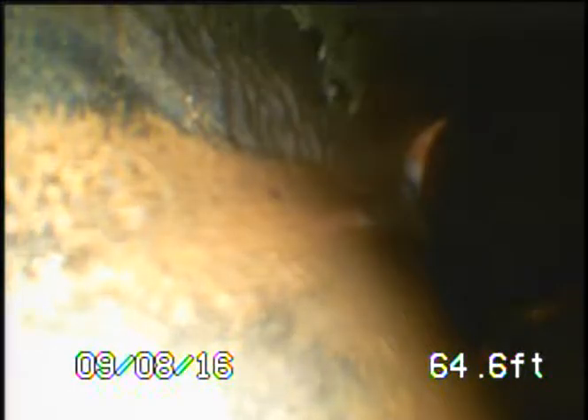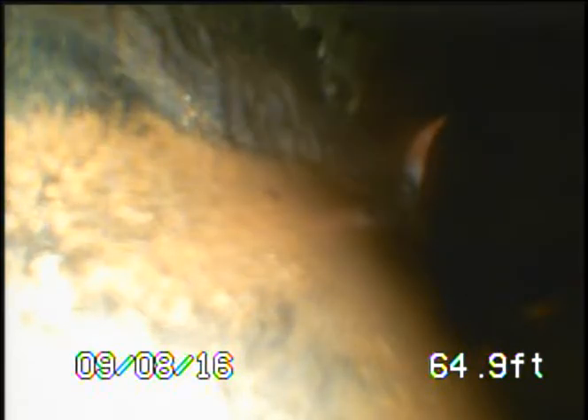We're actually dragging on debris — that's the top of the pipe, not where the water and wetness is. You can see the water on the bottom of the pipe. As we reach the plastic section, it transitions to four-inch pipe after the turn. Going vertically down and making one more 90, the four-inch is now transitioning to clay pipe.